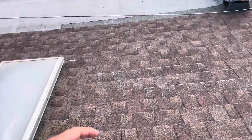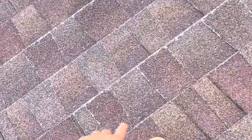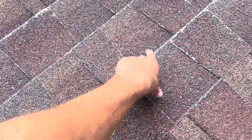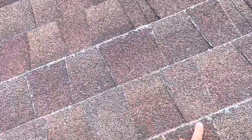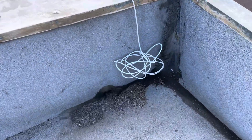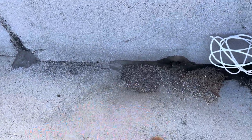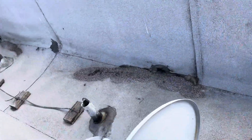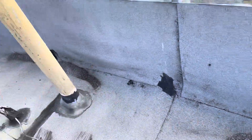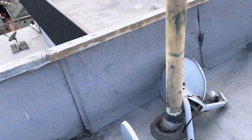We can see some wear and tear on this section — not sure from what — but you can see that fiberglass is starting to show on the outer edges of these shingles. And you can see on this flat section, this is where all the water is going to tend to collect. Right on the end here, you can see all the granule buildup around the scupper drains and a little bit of water staining, which tells us where the water is going.